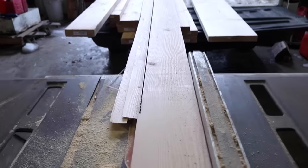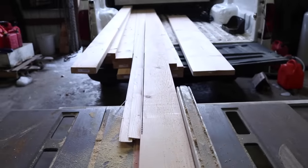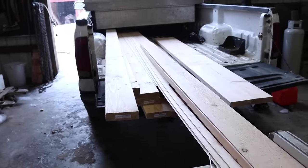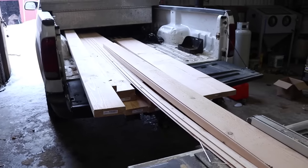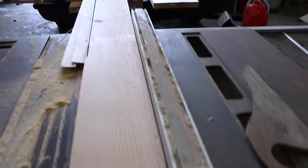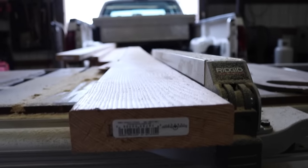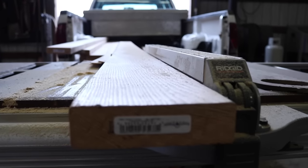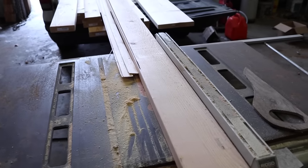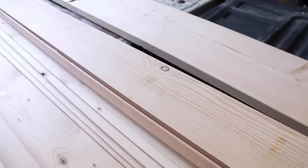What I'm doing now is ripping off all of the bull noses on the standard framing material. In America, our 2x6s are actually inch and a half by five and a half. The original rough cut is 2x6 from the sawmill, then after it goes through the shaper and the planer it comes down — they take an inch and a half off. One thing that looks bad on framing material — this is just inexpensive Doug fir, but it's been hand selected by me. I went through the whole pile and picked out really nice stuff. I was really lucky — I got stuff that was kiln dried and almost free of knots.